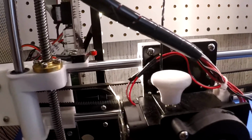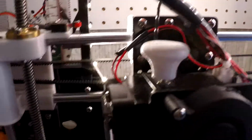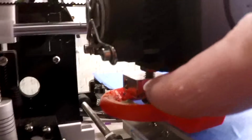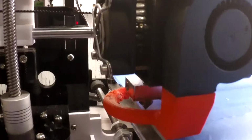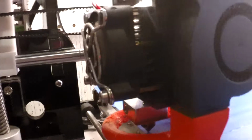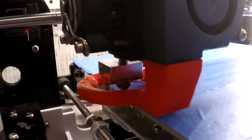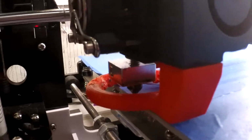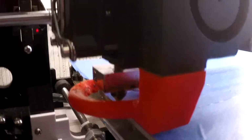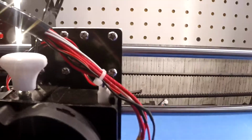Okay, so bear down on this, and I push down so the filament comes out the extruder down here, and then as I'm holding down this, I give a quick pull out, and I've never had, knock on wood, filament stuck in my extruder. That is my original extruder, 0.4 I think it is, whatever the nozzle is on it, really tiny small, and I've never had to replace it. That's the stock one. Everything pretty much is stock but the 2 fans on this job.